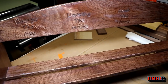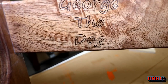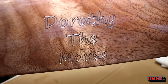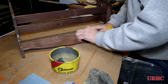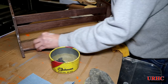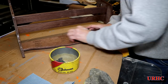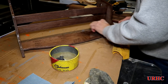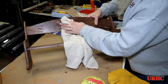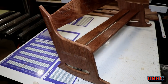You can barely see those letters in there, but if you get up close they look really good. I had to do a lot of sanding to get rid of any runs or bad spots between coats. Then I threw a second coat on and left it at that. These little things are a real pain to do with a brush — I have to find a little spray setup for it. I let that dry overnight, did a good sanding with 320, then went back to Johnson's Paste Wax. I've been using that same product for probably 50 years and I just love it. I'll wax it now and then go back in about two months when the polycrylic is nice and hard and wax it again for a real good final shine.